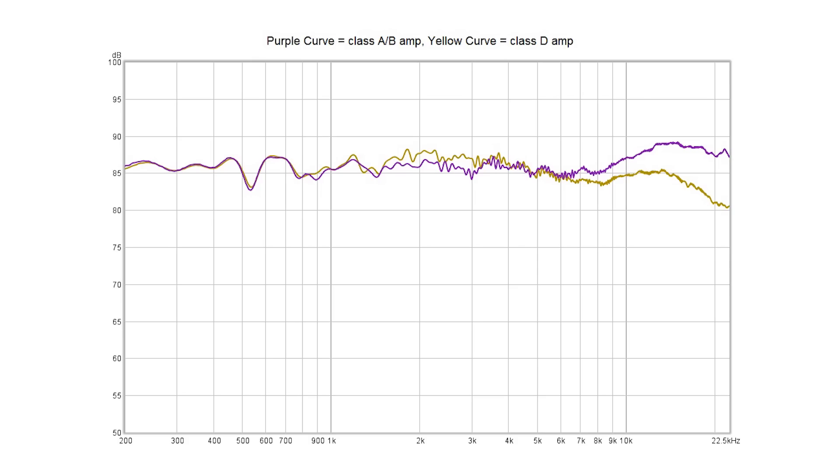The DA30 from Dayton Audio is not a bad little amplifier, but it's not really anything I would consider audiophile grade. The amplifier wasn't clipping — we were only testing the speaker at 2.83 volts, which is a little over 2 watts when you're dealing with a four-ohm speaker. But the problem is some speakers — and it's a very rare speaker that you see this — actually have a low impedance at high frequencies.